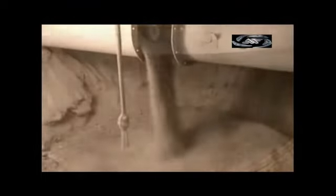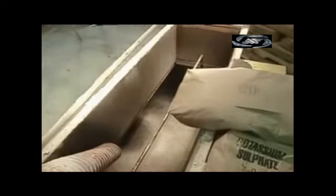In a mixing tank, meanwhile, workers combine water with several powdered minerals and chemicals, and chemical soap. The dry additives give the board the required structure, while the soap creates bubbles to make the board lighter.